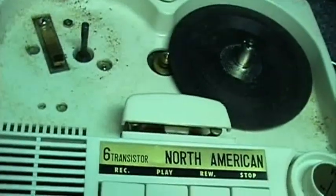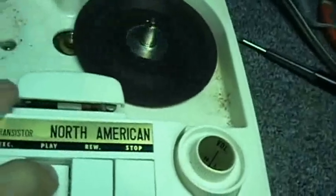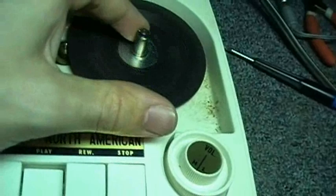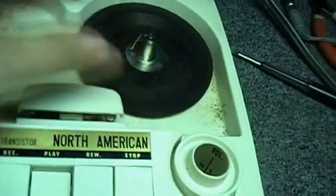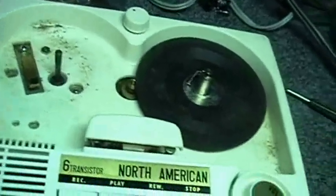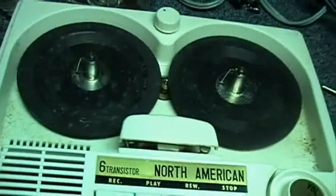Now, I don't mind a system like that when it comes to more tension on there and having a capstan drive machine that has enough torque to drive it. But when you're having to run it from a little rim drive recorder, usually the torque on rim drives isn't that strong. And, you know, if you try to stop it, it even slows down the motor itself. Same goes for rewind. So, it's not good to have it like that. It's nicer to have a pad.